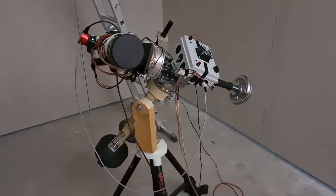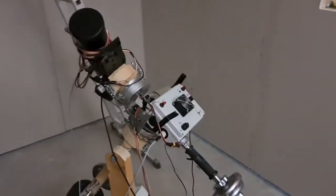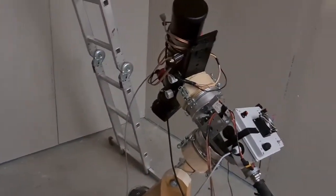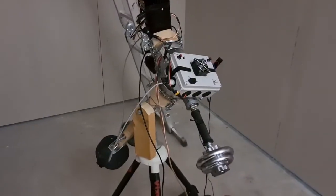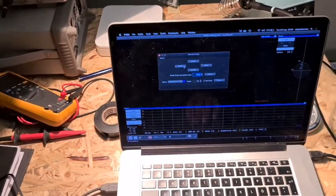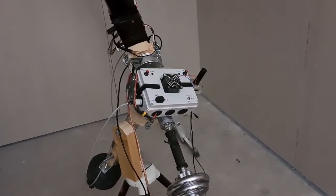It's not very high-tech computerized here. There's no app or any other sophisticated control in it. You have the 2 knobs there to control right ascension and declination. Right there you have a guide input from a guide camera. You can send the move commands via USB, or you can send guide pulses manually through PHD2. You get a little indication when you do a movement, right ascension and declination, and it moves. What else do you want?